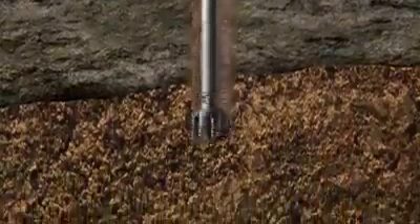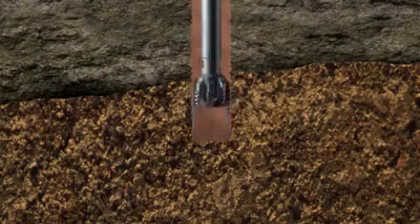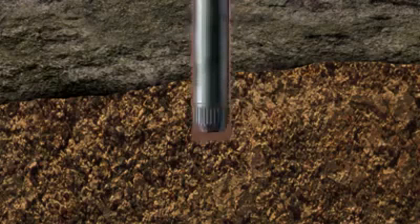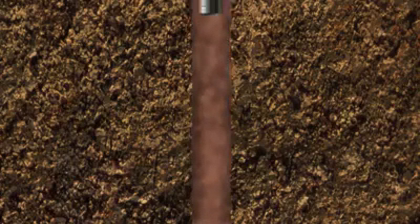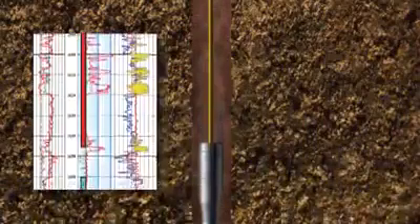When the well penetrates a potential reservoir rock, the oil or gas may be detected by analyzing the drilling cuttings for traces of gas and/or oil. At this stage, it is essential to gather as much information as possible about the reservoir. Two methods provide most of the information. In the first, the drill bit is replaced with a diamond-studded coring bit at the bottom of a core barrel, which can cut a complete section of the reservoir rock and return it to surface for detailed analysis. In the second, coring may be replaced or complemented by running a suite of geophysical logging tools, which are run on electric wire line — instruments that can measure the physical properties of the rocks as they pass slowly through the wellbore.